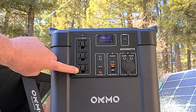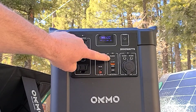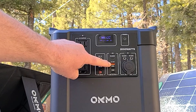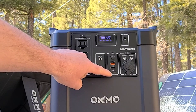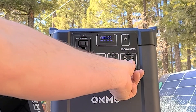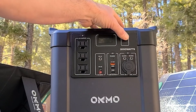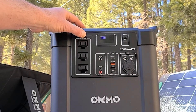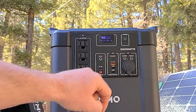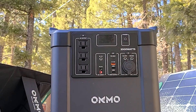You have three AC outlets here, DC input ports for your solar connections, a PD 60 watt USB-C connection, super fast charging USB 3.0, and two normal USB 2.0 ports. There are also DC 12 volt connectors and a DC output plug. To operate: hit the power button once, hold down to activate AC outlets, click for USBs, click for DC — you can turn all of these off independently or turn the whole unit off.